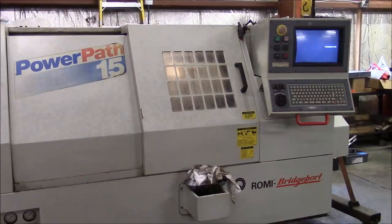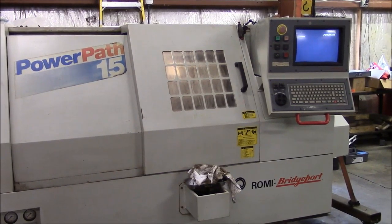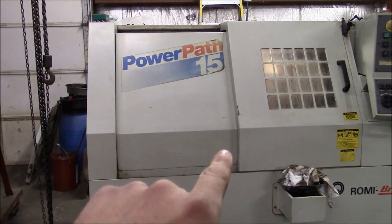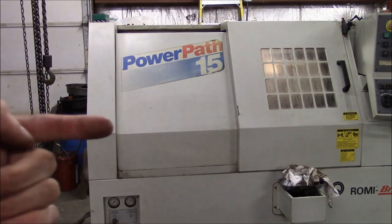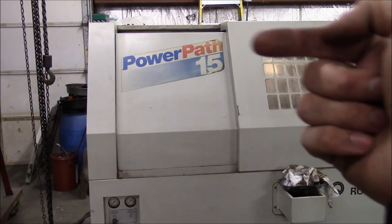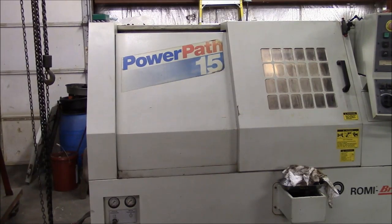Let's figure out how to do that. Looking at the side view of the machine, we're going to have to remove this panel right here — it's got screws from the inside of the headstock area in both directions. I've tried to make this adjustment before on different machines without removing the sheet metal, and every single time I wished I had just gone to the trouble to remove it. It's so much easier. On this one I don't even think it's possible to get to the adjustment screws without taking that sheet metal off. Plus, somebody's clearly taken this panel off before — you can always tell because the lazy bastards didn't put all the screws back in.